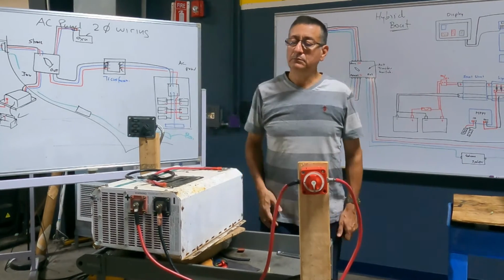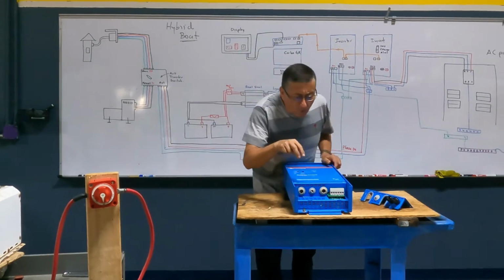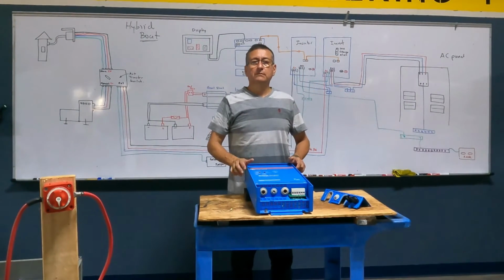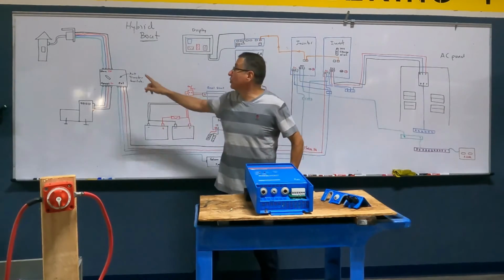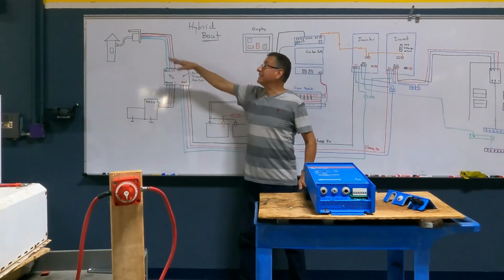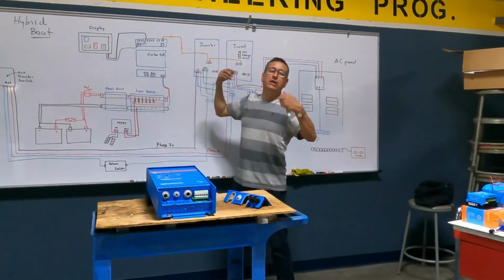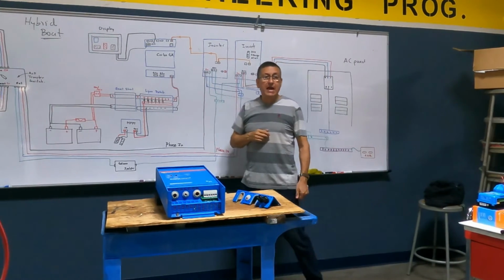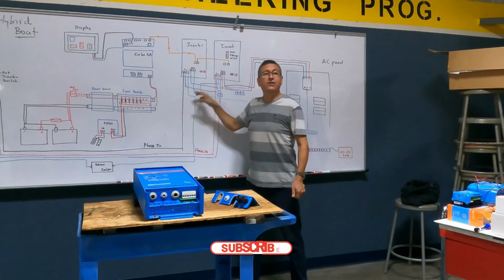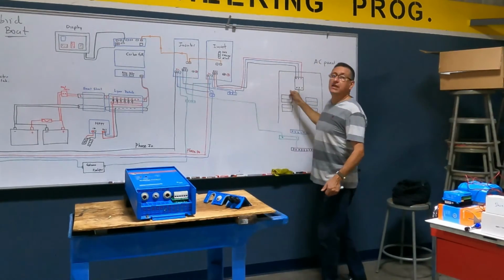This one is the tradition. The new one is more intelligent, because this one has one constant AC power in and one constant AC power out. That AC power in is coming from those sources, shore or generator, through this automatic transfer switch. That one detects which one is on and moves it over there, and allows the inverter to receive input power always. That's okay? And of course, in the output, you always have AC power. Doesn't matter if it's inverting from DC or if it's passing directly the AC coming from the shore power directly into the panel. Everybody follow me?